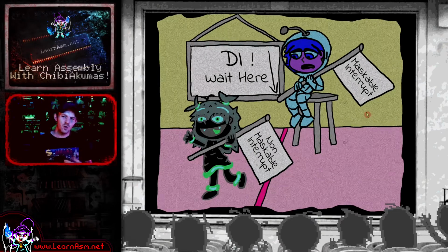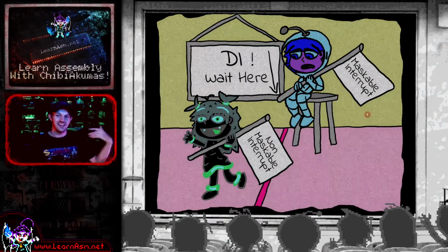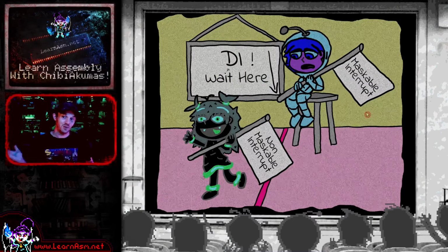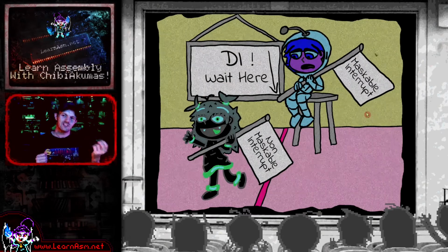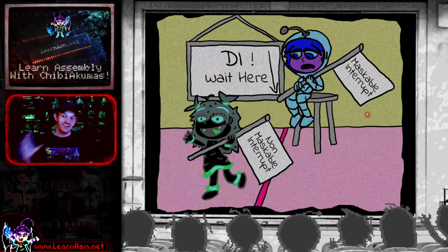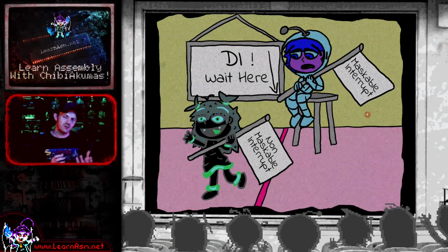It's kind of like if you're at work and you've got two people who might try and ask you for things. Maybe you've got the person who's beneath you, and they come and try and talk to you and you tell them to go away. And maybe your boss phones you and you can't do that because it's your boss, and you've got to deal with what they're asking for right away. Now, this is basically maskable and non-maskable interrupts. Now, maskable means that we can put a bit of masking tape over their mouth and shut them up and ignore them for a while, and non-maskable means they're going to have to be dealt with no matter what. And that's the two kinds of interrupts that we have.